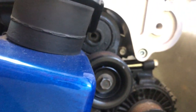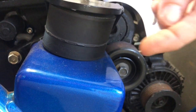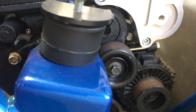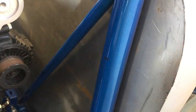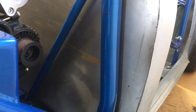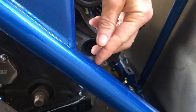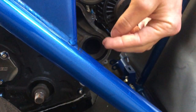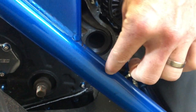I'm going to use this joint here where it levels off on that side. The actual oil cooler sits about 30mm higher than this bit of box sectioning, so I'm going to have a face coming up 30mm higher so it comes in line, with a 45-degree fillet in there for bracing support. I've measured the outside diameter of both pipes on this tubing so the bracket can go around them, giving a longer weld line and extra strength. It should be plenty strong enough with 3 or 4mm steel.